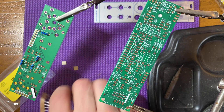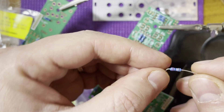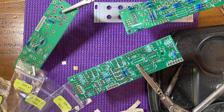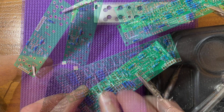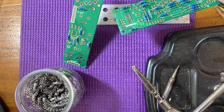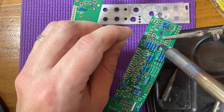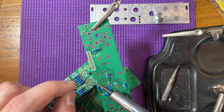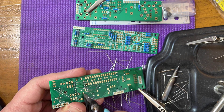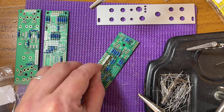Let's start with the resistors. I like to plug them all in before I start soldering. Bending the leads close to the resistor body before plugging them in will make it easier. Once they were all in, I soldered them from the top. Then turn the boards around to trim the leads and touch up the soldering. I actually did this to all three boards at once, but we'll focus on the outer board now.